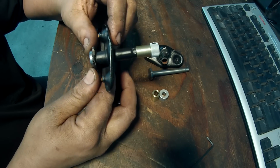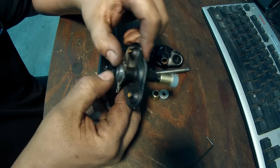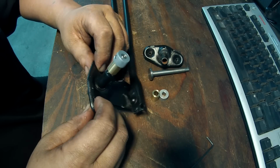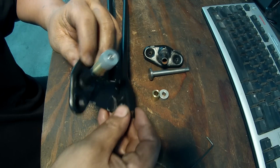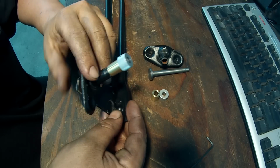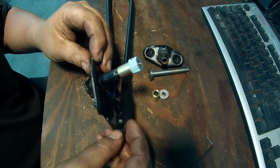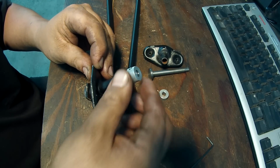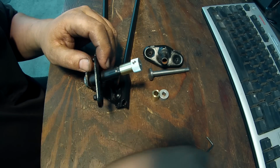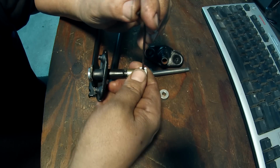And of course that'll be welded there. We'll put at least a couple nice TIG welds on that, and then this piece rotates, because this is bolted to the body of the car. So the bracket in here is doing this, moving, and, well, I can't do it by holding it, but maybe you get the idea. As that's rotating back and forth, this pin's moving with it. So I gave them what they wanted. They needed some more height there, and that's what I did.